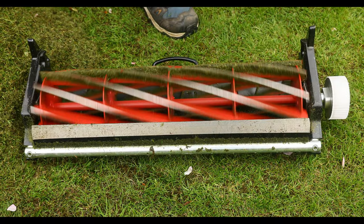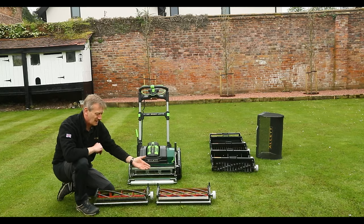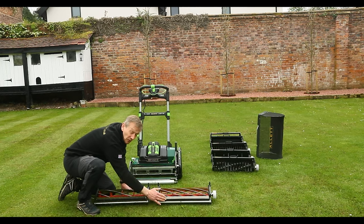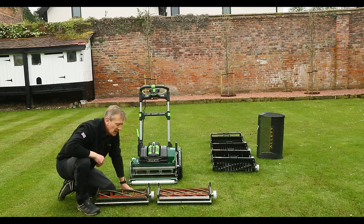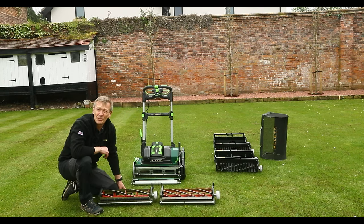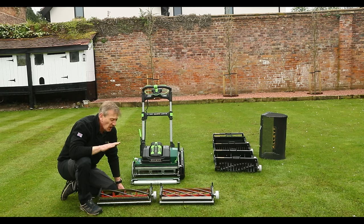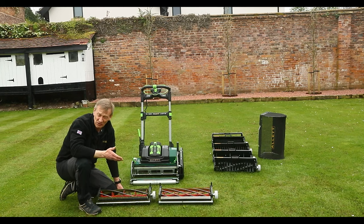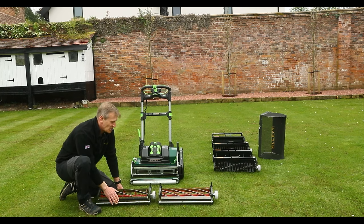Because you're going to be cutting lower with a 10-bladed cylinder, the same thickness of blade is machined off at the front, which now gives us a blade at the cutting point of three millimetres, so I can go really really low with this. That's particularly good if you're mowing a bowling green or a cricket wicket — it really helps to achieve the lower heights of cut that this one can't quite achieve.